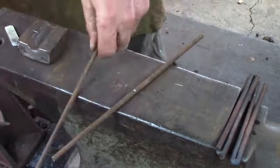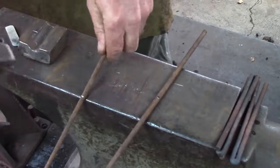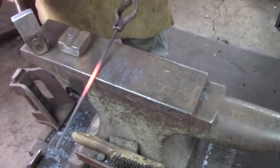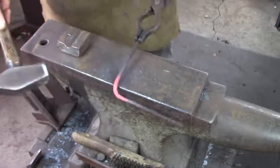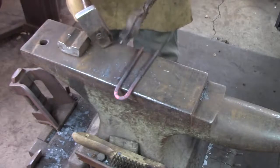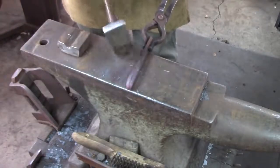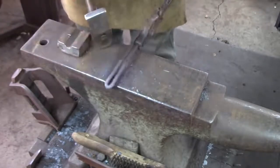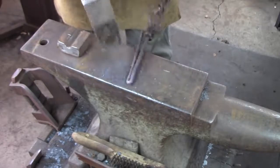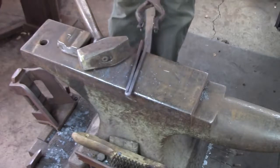I take my hammer, find a nice radius edge, and that gives me a nice soft mark that I can bend around. Finding it on the anvil — if I need to look at the two ends, I can see which side is shortest, so that side stays up. As I hit it, coming in from the end, it starts to equal out the two ends. Once I'm equal, I want to work from both sides equally or alternately, and leave the open end slightly open.